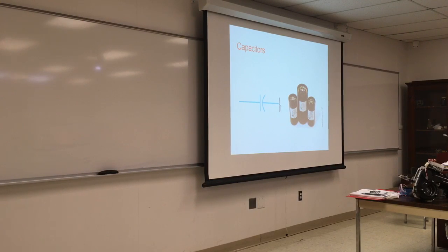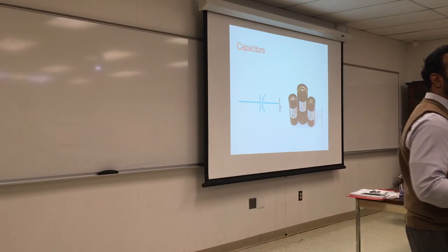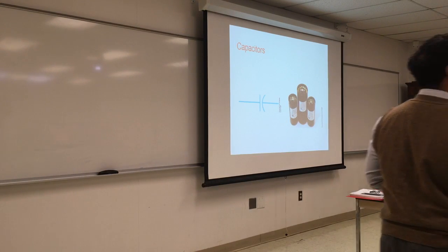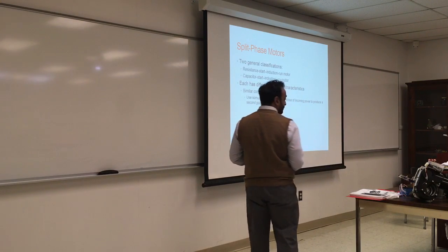His motor had a cut wire for the capacitor, so there was no capacitor. Once he pushed it, it moved. That means that the run capacitor is bad. Take out the capacitor, make sure it's wired correctly, and make sure the capacitor has the right microfarads in it. Split phase motor, we talked about split phase.